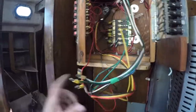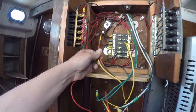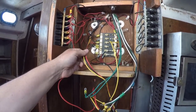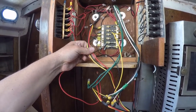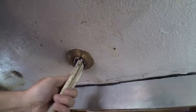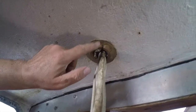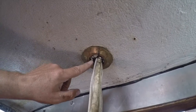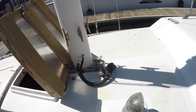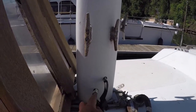I'm going to cut these spade connectors off, pull the wire through, and get it out of here. Everything else should be okay — I still have running lights, though I don't have a steaming light or an anchor light. It's kind of interesting — you can see where the wires go up through the top of the cabin. It looks like they used a brass through-hull for it, and I do remember seeing threads on the other side, so they filled it with some sort of caulking.